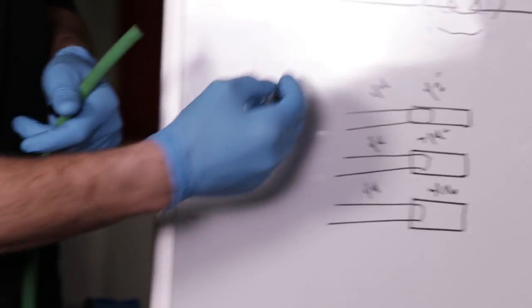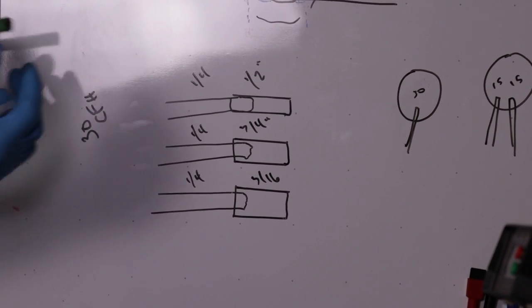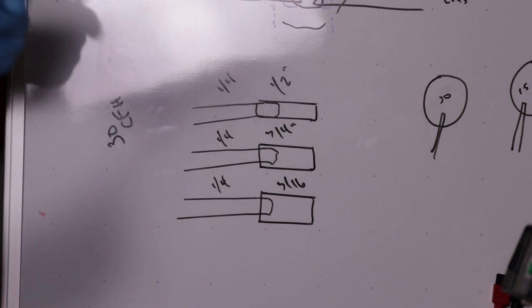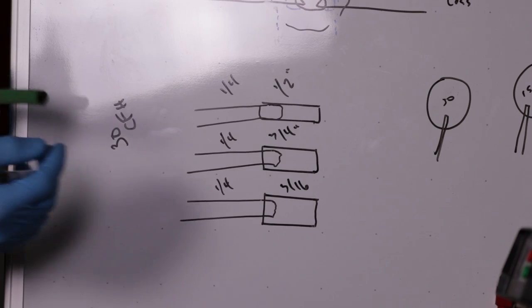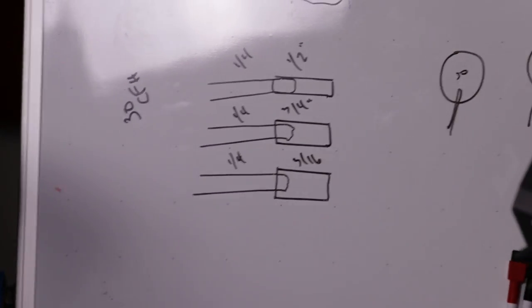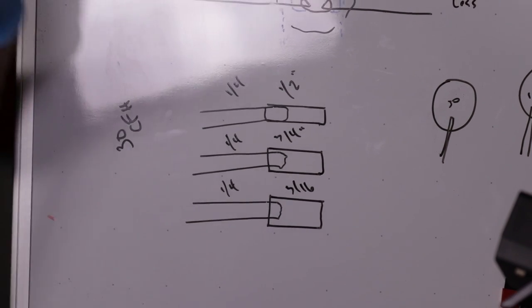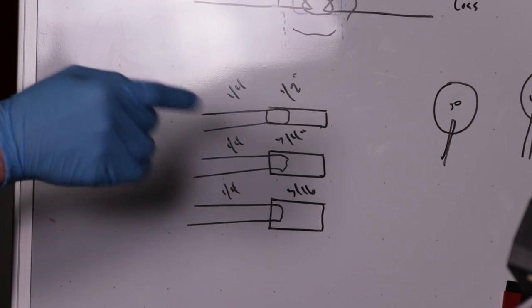There are charts for two-inch, three-inch, four-inch, six-inch, and 12-inch pipe that show the number of hoses to use, the ID of the hose, and also turbulence. For example, if you have a quarter-inch hose and set your flow rate to 30 CFH, it may be very turbulent. Using a purge monitor helps with troubleshooting — you may be able to detect that your flow rate is creating turbulence and drawing in atmosphere, influencing your purge quality. There are quite a lot of variables that go into purging material.